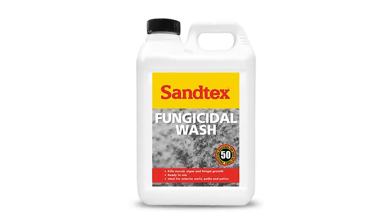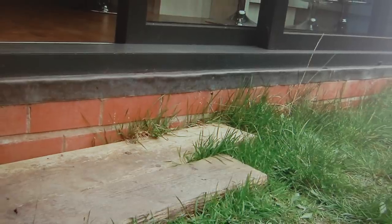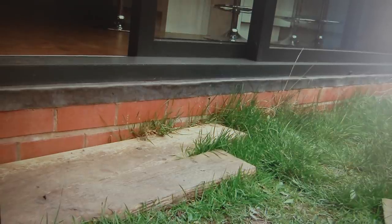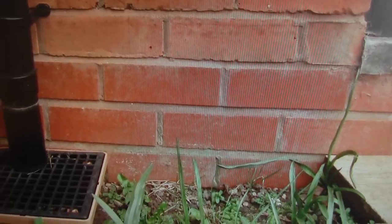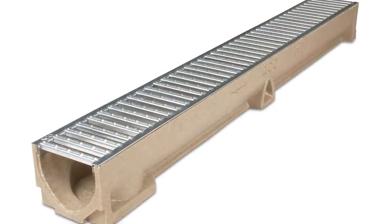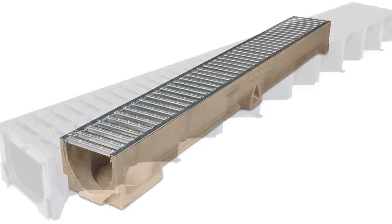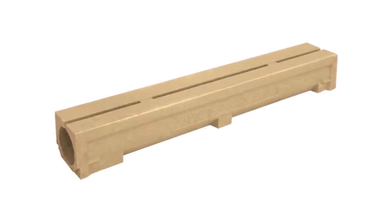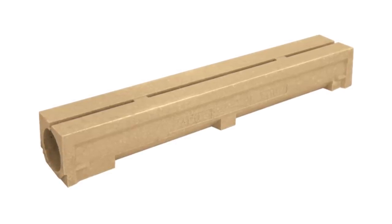Les Richards wants to put in level transition decking — the outside decking at exactly the same level as the floor for a nice transition through. He's worried about damp, quite rightly, because you've got a damp-proof course and you shouldn't bridge it — stay six inches below the DPC to stop splash-up. With cavity walls, a little soaking on the outside skin doesn't always cause rising damp inside. He's got a nice gully there, so he can put in what's called an Eco drain — a slotted channel with a mesh over the top — available in stainless steel, black plastic, or a nearly invisible grooved version.